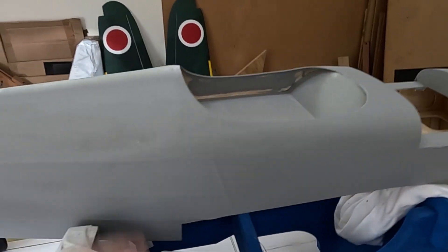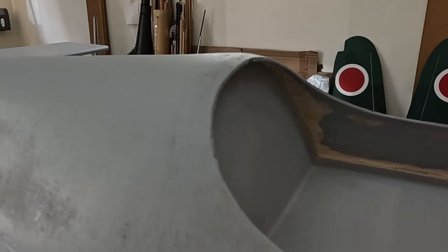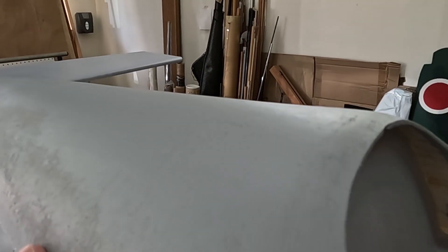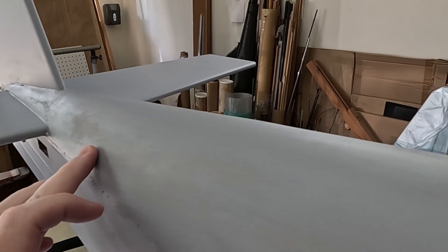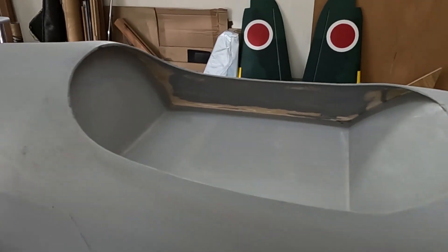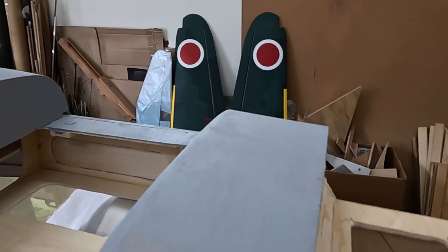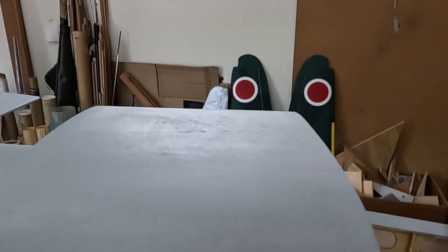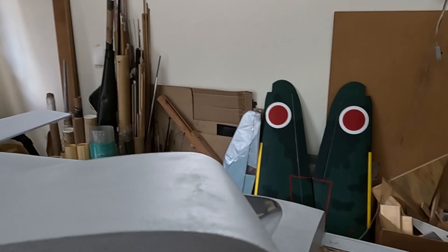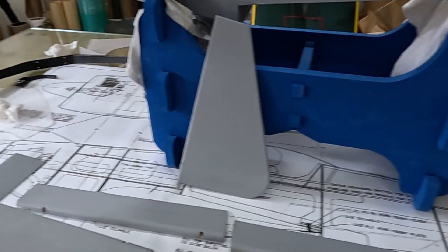I applied the flow coat to the flight control surfaces and the top of the fuselage — the sides that had fiberglass — and the wing got the peel ply. Here's a quick look along the top of the fuselage: it's not perfect, there are some areas that are a little bit rough and show a little bit of weave, probably where I didn't quite get the peel ply saturated with the epoxy. But these are easy to fix. The top of the battery hatch was also done with peel ply, so it's pretty nice and smooth. A second coat of primer will probably be good enough for this.